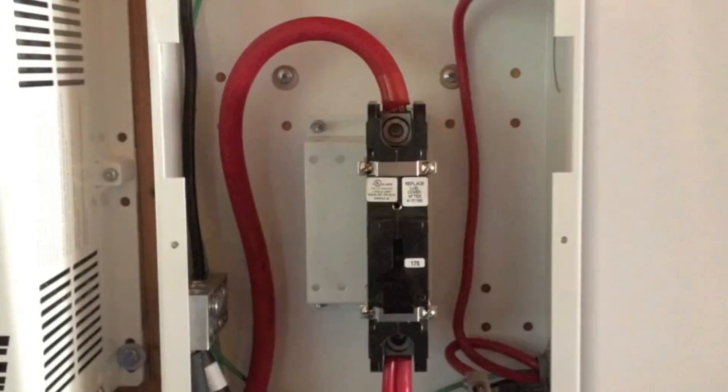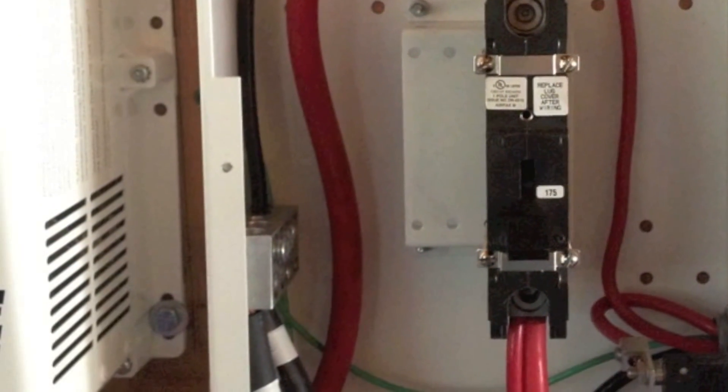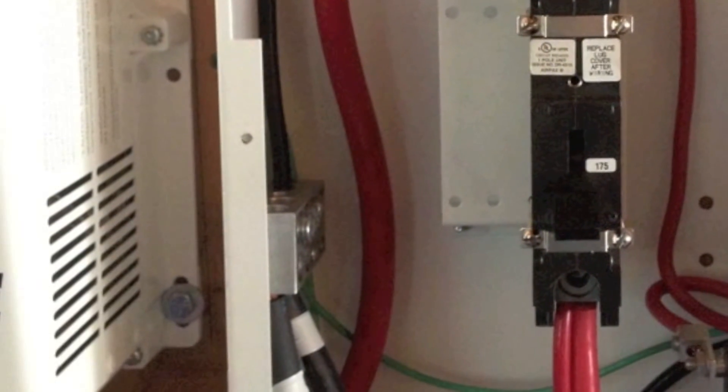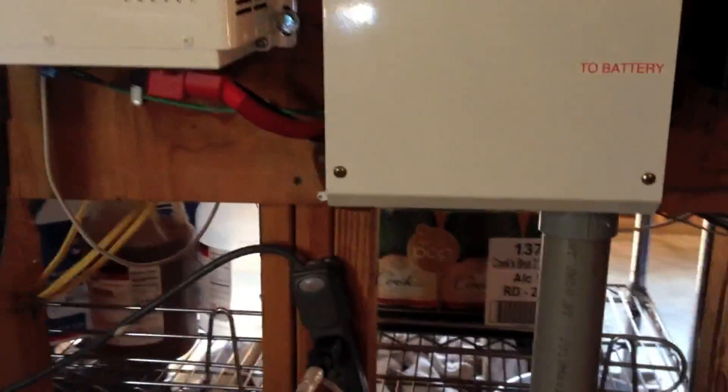This other wire — a familiar green wire — is where we've grounded the inverter. We've taken that back into the ePanel, where we've grounded everything on a neutral grounding block. The neutral bonding block creates the neutral-to-ground bond, and there should only be one of them in your system. From that neutral-to-ground bond, we take it on this exposed copper wire all the way down this side here.